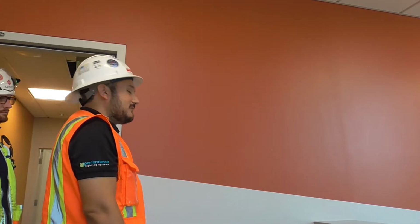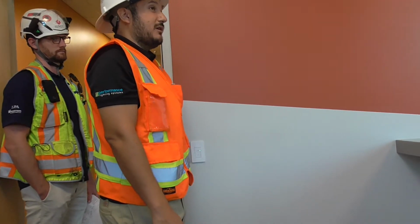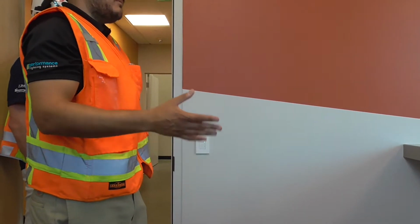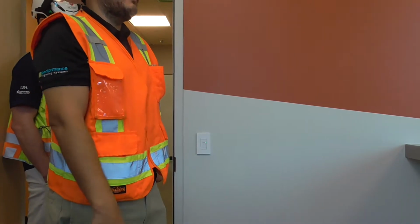You actually have to push and hold? Yeah. Can you program that switch so that pressing on again changes it? To go to 100? So basically, if you just push on again, it'll raise to 100? No, so per Title 24, can't do that. And that's why everything was programmed that way, on top of the regular sequence of operations.